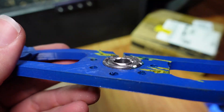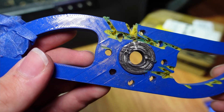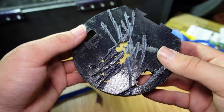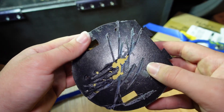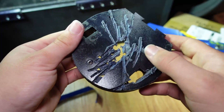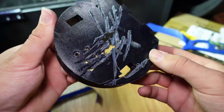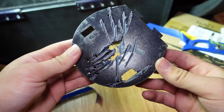Well, this you do not see every day — look at that, just notching through a hardened steel bearing race. That's kind of insane. Unfortunately the diamond saw, which is really an abrasive grit more than a saw, really doesn't like plastic, which isn't surprising — it's just trying to friction melt through it, so it's not gonna do a whole lot. You get all these lines that barely go deep at all. This would not work against a plastic-bodied or plastic-bottomed opponent — I would definitely switch to a toothed AR500 saw or other toothed saw to get through a plastic opponent.